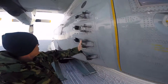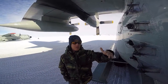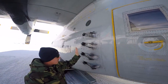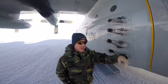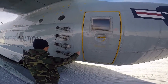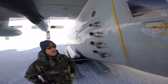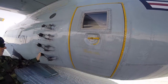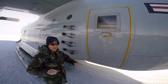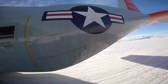The only drawback is because of these JATO mounts, you don't have air deflector doors. They'd usually be right here — they extend out in the slipstream so that when the C-130 is used to drop paratroopers out of these doors, it eliminates the buffeting and initial shock to paratroopers. So this plane can do anything a C-130 can do, you just have very limited ability to open these doors in flight — it's extremely hard. As soon as air flow goes over, the door actually opens inward for a second. It's designed that way so it pressurizes and doesn't fall out — in and then up.